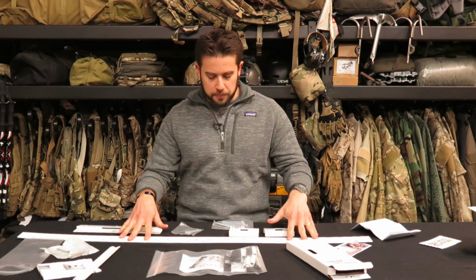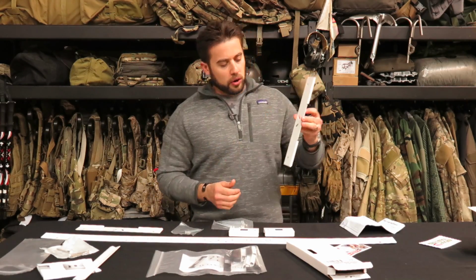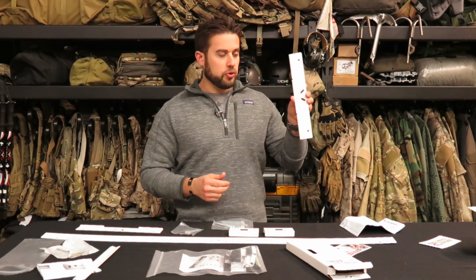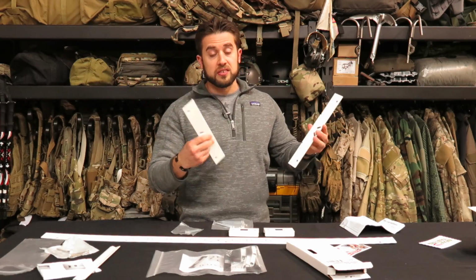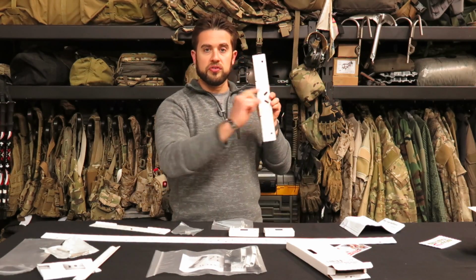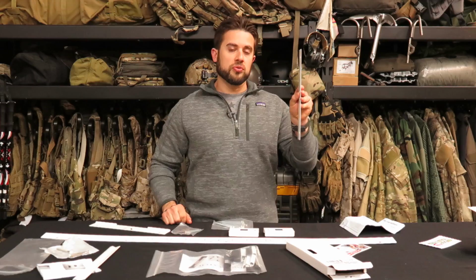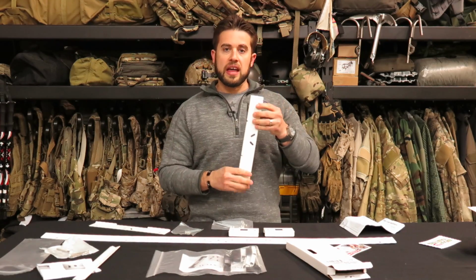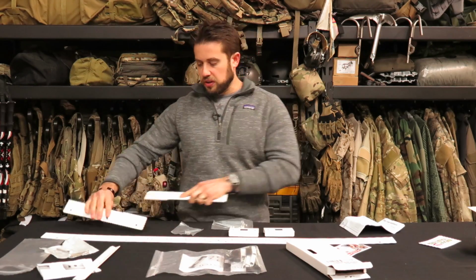And what I like about Armor Concepts is that they include a couple of different things too. It's not just a plate. They also include these hinge shields, is what they call them. The way these work is that this fits over 2 of the 3 or 4 hinges on your door. Some doors have 4, especially big front doors, and some have 3. On 2 of those, you pull out the middle screws in the hinges, slap on a hinge plate, put those screws back in the actual hinge, and then add in additional screws on the top and bottom of this. So if you think of that distribution of force again, you're doing the same thing on the hinge side with these big plates too. So that's 2 locations that it does that.